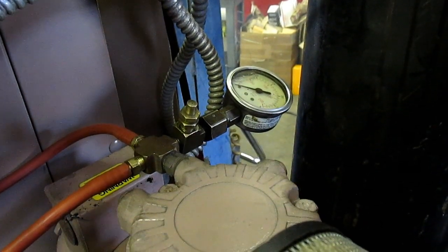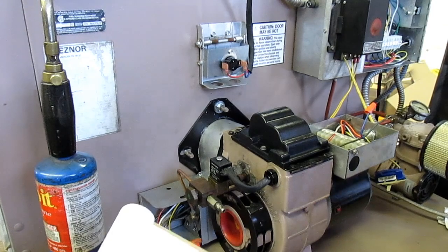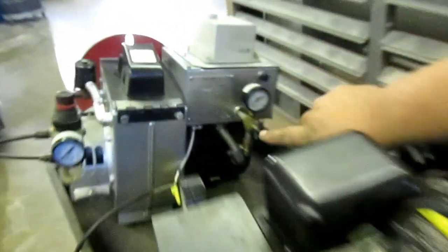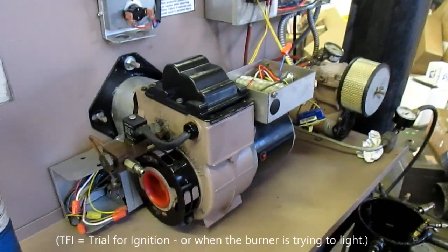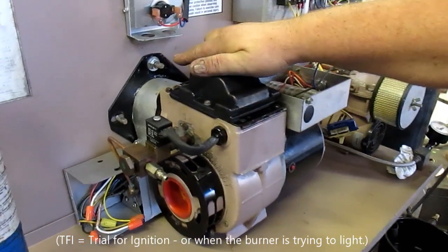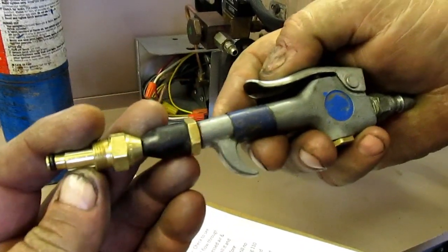Next, oil should spray into the chamber like a heavy fog. If not, check for a steady oil flow for at least three minutes at the bleeder oil inlet four-way T fitting or the regulator on most models. With an old style pressure system and oil pressure regulator, check that the oil pressure is correct during TFI. If there is still no oil flow through the nozzle, remove the nozzle from the burner and blow backwards through it with compressed air. Make sure you can see through the nozzle, or it's not clean. Then reinstall the nozzle and retry.